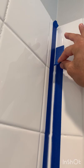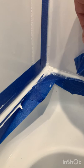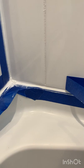Now the big reveal — I'm going to peel the painters tape off while it is still wet. You do not want to wait until it dries; peel it off while it's wet so that it doesn't crack. Oh, how satisfying — like pulling off a scab. So far it looks pretty good to me, a nice straight line. The corner could be tricky — let's see if I did my corners okay. Oh, that's clean — super clean, very happy so far.